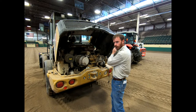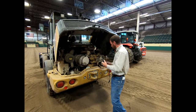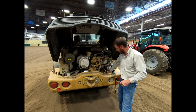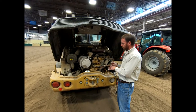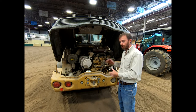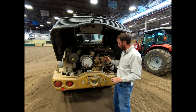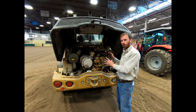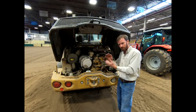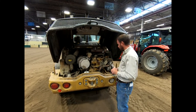When you talk about cost comparison of that tractor versus this loader, that tractor is a better bang for the buck. Here we've got our entire engine compartment — again, on the filters you can see we've written on them. This was done on October 16th of last year at 1,138 hours. On a lot of our newer pieces of equipment, whether the tractor, skid steer, or this loader, we're packing things in and everything has sensors on them telling you when your oil's low, hydraulics are low, or you're overheating. It makes it tougher to work on them yourself, though you can generally still do preventative maintenance like oil changes, hydraulic oil, and fuel filters.